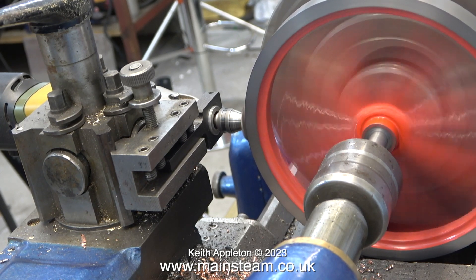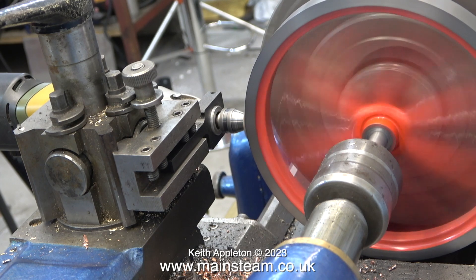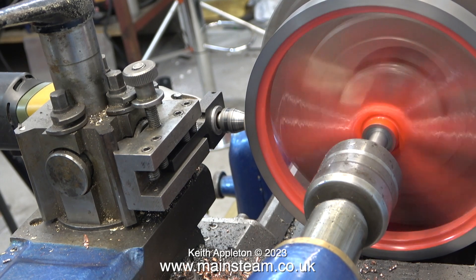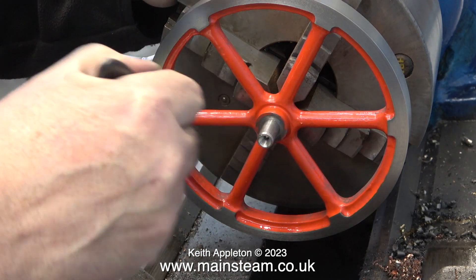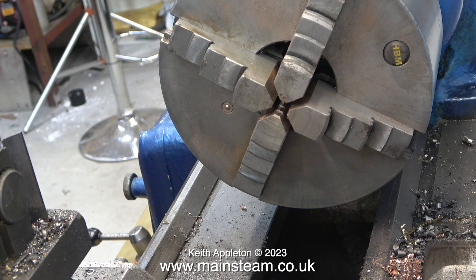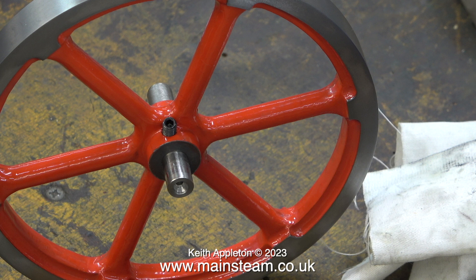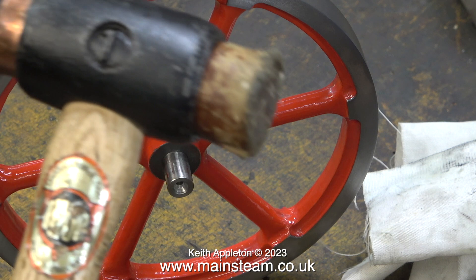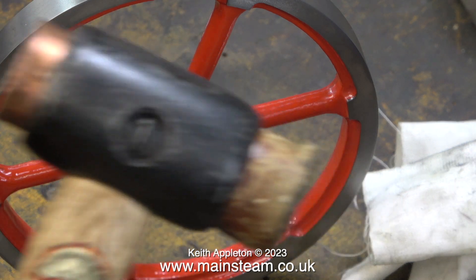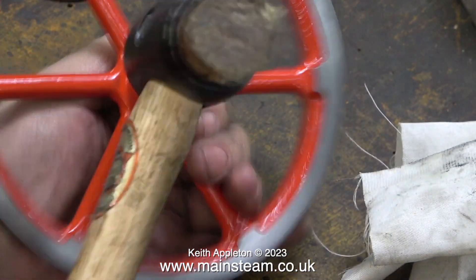What I'm doing at the moment is grinding the other side of the flywheel. I didn't have to remove the flywheel and turn it round — I just moved the flapper wheel to the other side. I thought it would be a good idea to remove all the cast iron dust from the paintwork before I remove the flywheel from the chuck. This piece of silver steel is exactly 7 sixteenths of an inch, and once the grub screw marks it, it doesn't want to come out of the hole. I used a copper faced hammer just to persuade it.